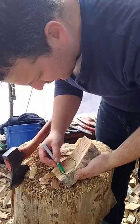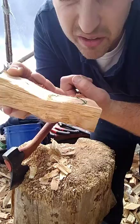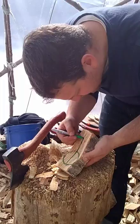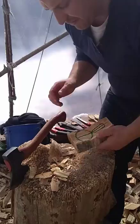So put the bowl of your scoop all the way on one side. And then what you're going to see is that instead of having this be level, this is going to be level. And that naturally pops up the handle from the level rim. So again, find a center line in the bowl. It really helps me stay symmetrical. And I find handles that flare out as they reach the tip of the handle are always easier to carve because it's real obvious which way the grain needs to go.